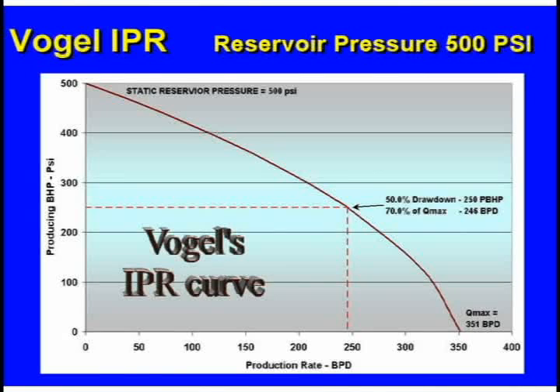There's 200 pounds casing pressure and that caused a little bit of pressure. He's pumping in the well, pounding fluid, and tearing up his pumping unit — he needs a pump-off controller on it. But he's still got 250 pounds of back pressure down at the bottom of the well, and he's only got 500 pounds driving it.